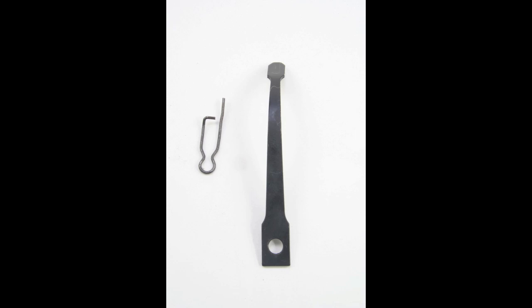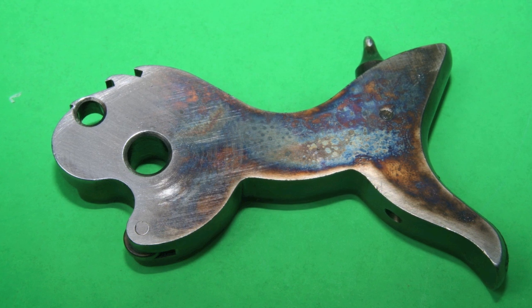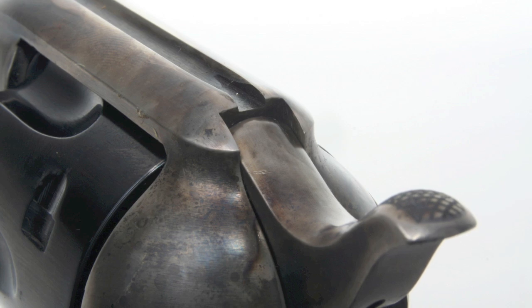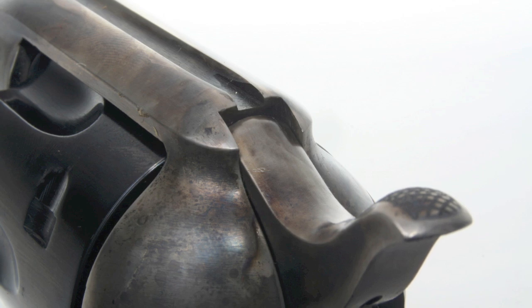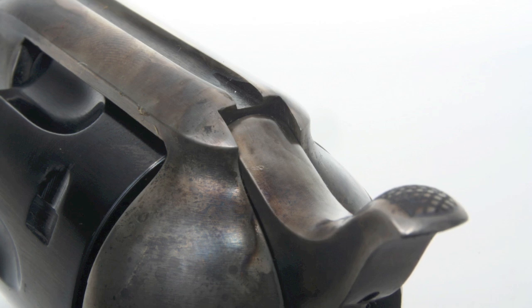It's fully tuned by Taylor's gunsmiths and it has a reduced power mainspring and a wire bolt and trigger spring for longer life. All the parts, all the pins, all the contact surfaces are polished to make them just as slick as glass and make it a very smooth operating single action revolver. One thing I like about the Smoke Wagon is that it has second generation Colt type sights, which means it has a wide square rear sight notch and a fairly wide blade front sight, as opposed to most of the replicas you'll see that have a pinched rear sight, very small shallow V, and a very narrow front sight. When your eyes are getting a little bit older, this is great to be able to see what you're shooting at.